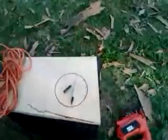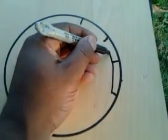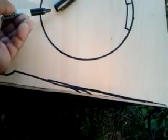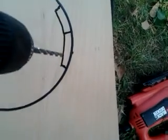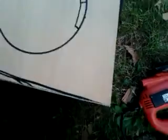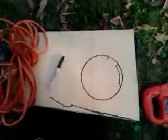So back to this thing over here. I take it, best as possible, and go around it making contact like this all the way around until I get the circle that I want. Then after I get the circle that I want, I'll take my drill and go right about here — outside of the line, not inside the line. I'll drill down into it, make my hole, then take my jigsaw, place it inside the hole, and just go around. That's it. That's what I do.